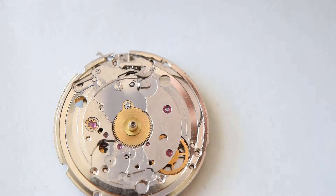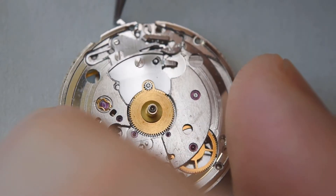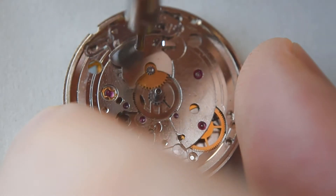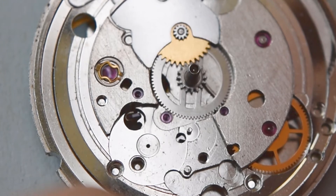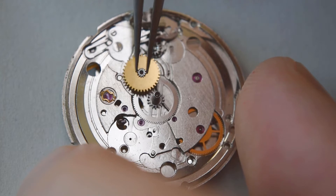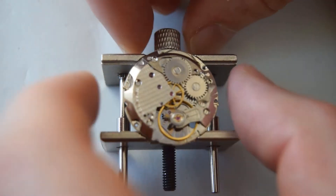And the person on the dial. This is what we can find behind the dial, and that's the movement. Let's push back these hooks - our wheel - and here we have some protection plate. The watch started to work again, so probably somewhere here the whole movement was blocked. That's a good sign, of course, when the movement works. It's 28,800 beats per hour - it's a high-beat movement. That's great. ETA 2801 - it's the first generation, we could say, of this movement.